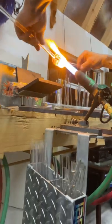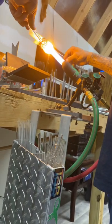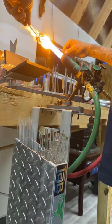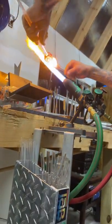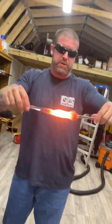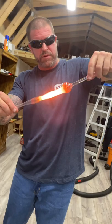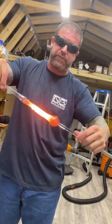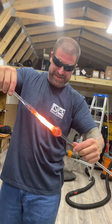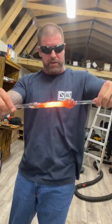Stay more towards the mouthpiece side — stay away from the part you're going to make your bowl. Everything else is just working the handle. Once it's melted in with a nice separation between the clear and the colors you drew inside, take it out and use gravity: flow toward the mouthpiece, flow toward the bowl, back toward the mouthpiece, lightly stretching with your hand — not pulling hard, just flowing.